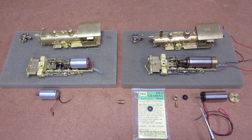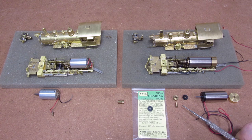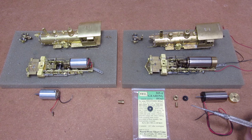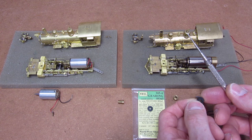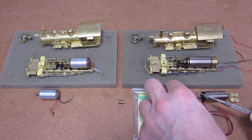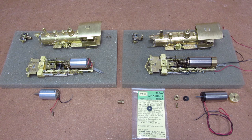I've got the parts laid out here. This is a Northwest Shortline replacement part — it's a 305-6 gear, specifically for a whole bunch of these Westside models. Spend money with Northwest Shortlines so that they stay around; they're a really important resource and if we didn't have them we would be screwed. This is the brass idler that came out with the brass pin, and this is the Northwest Shortline gear for comparison. Because this gear doesn't have a hub, it was kind of wobbly and unsupported. So I bored this out and sleeved it with a brass sleeve so that it was more like this profile here — well supported. That's critical; I had trouble with the gear trying to deflect and bind.